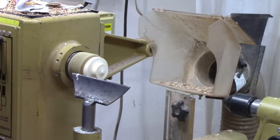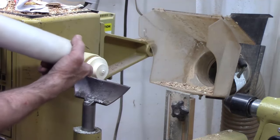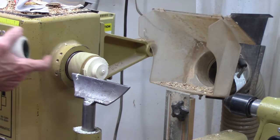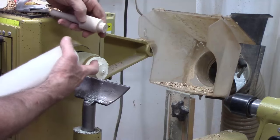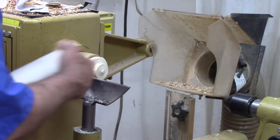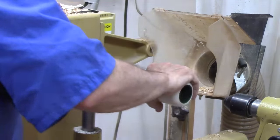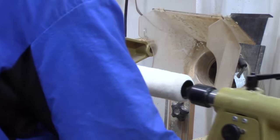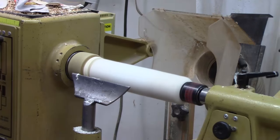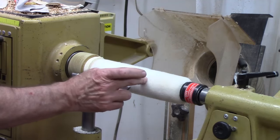If you make a lot of small stuff — ornaments, game calls, bottle stoppers — this is what I'd call a poor man's buffer. You either make a morse taper with an inch and a half plug on the end, or you do like I did: use a threaded block, glue on a piece of scrap, turn it down to an inch and a half where it just snugly fits in a paint roller. You can use synthetic or lambswool, bring up a cone, snug it up slightly, and there you go. You can actually use three compounds on the same piece — Triple E here, White Diamond here, and wax here.